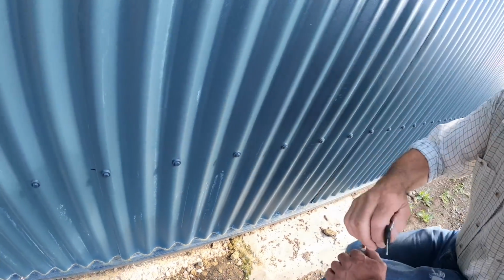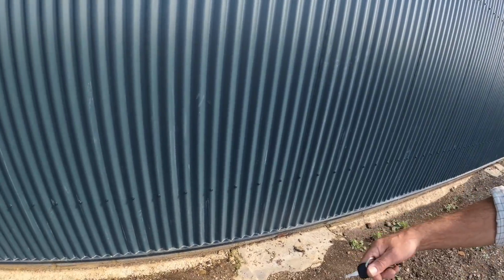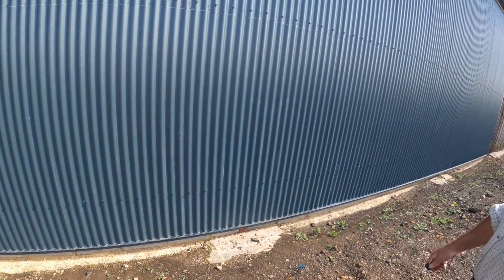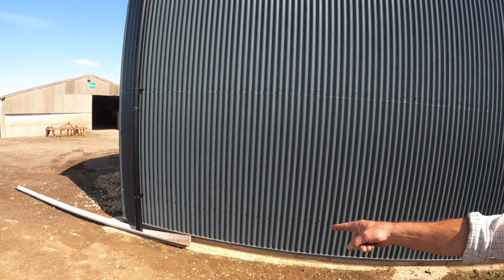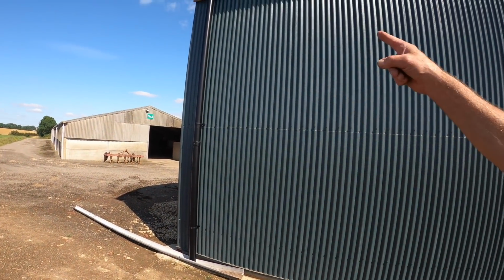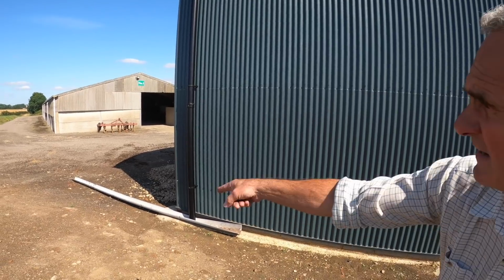And now that leaves it ready for putting a drain here, so if any drips go into the drain, sort of like a French drain, and then that French drain could pick up with, we'll have to do an underground drain from that downpipe. It's a new downpipe. New downpipe there off the gutter, yeah. We're going to take it to that point over there.